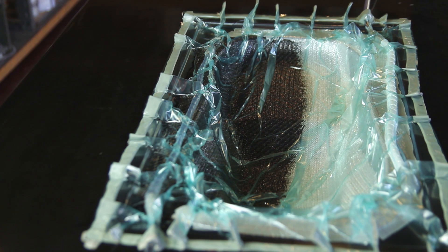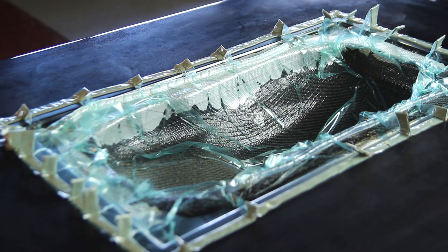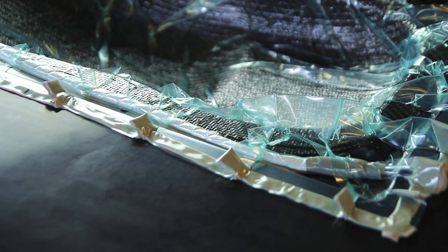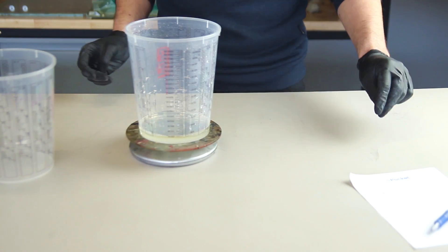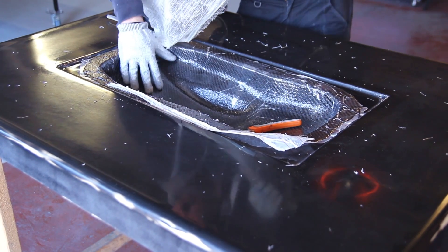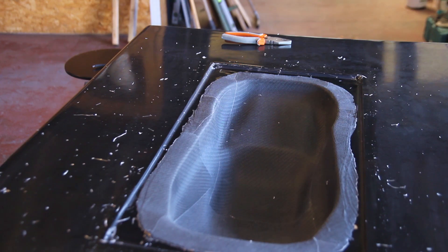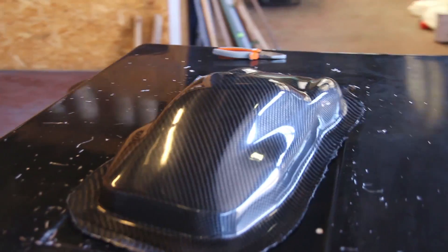The most important thing is that pinholes and such are mostly caused by infusion and vacuum lines that aren't well aligned, leaving dry spots, or because the infusion is running too fast — so you want to throttle the speed. Sometimes it's a little game: you slow it down, then speed it up. Here you can see the importance of the resin break as well — it slows the resin at the end, allowing any unsaturated fibers behind the resin front to saturate. As you can see, my calculations were quite good; I was left with just a bit of resin.